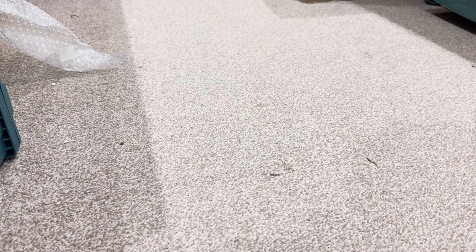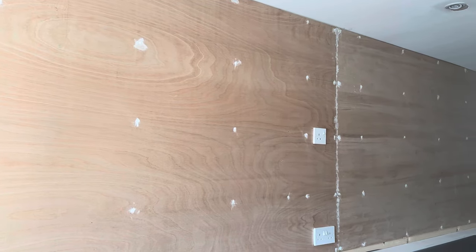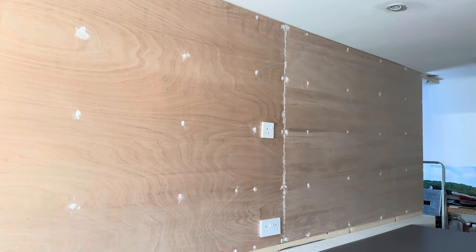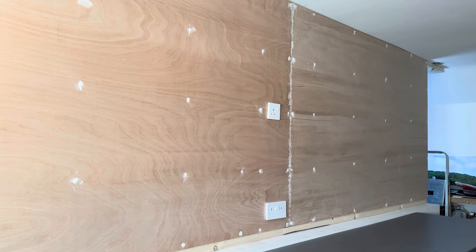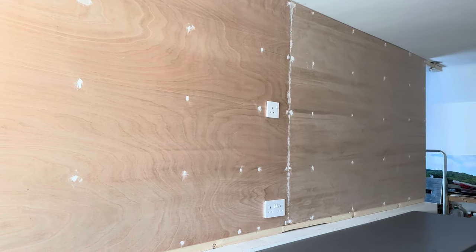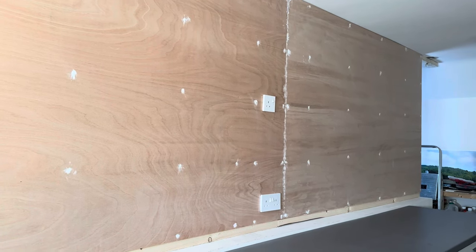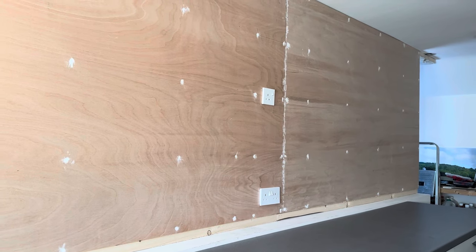We finally have a wall, and I've just been filling the screw holes, ready to sand them down. I'm going to paint it white just to give it some more lightness in the room. As you can see, the boards themselves are 12mm to 20mm, and the height of the wall was 1260mm, so I've got like a 40mm fillet just to put in there across the bottom.